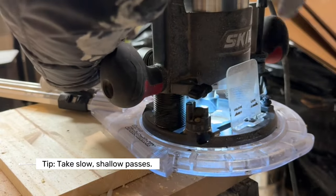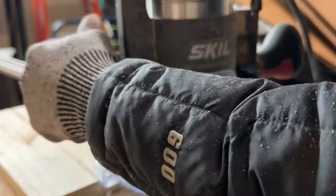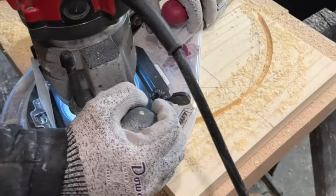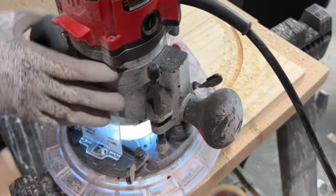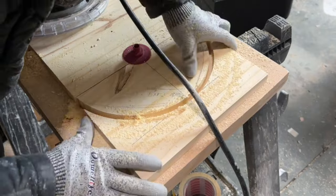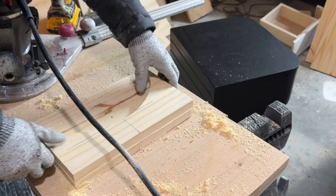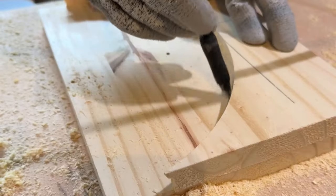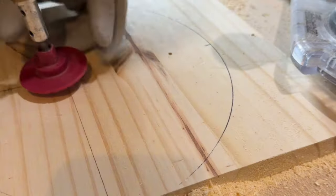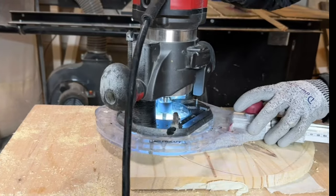I'm using the Milescraft circle jig. Make sure you're taking really, really slow, shallow passes. It's gonna take a little bit longer, but you are going to prevent any kickback. You definitely don't want that with a router. I'm using a spiral upcut bit for this router. It makes a really clean cut. I'm not going to have any burn marks, and it's really easy and repeatable. So I'm going to link all that in the description as well.